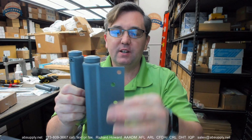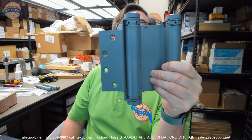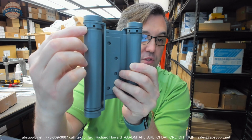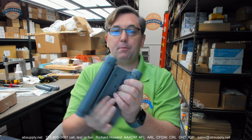Non-template, well, that refers to the 6-inch hinge or the jamb leaf, but this is absolutely what's called a template. The location of those screw holes are the template pattern. This is indeed non-handed. You can install them with the tension collar. You see it here and here. You don't see them down here, towards the top or towards the bottom of the door. And if in fact you're doing a pair of doors, the manufacturer of this hinge will recommend that you turn one upside down.